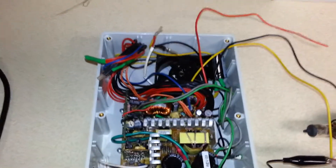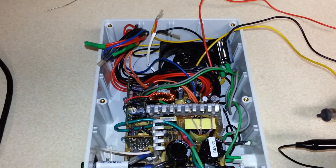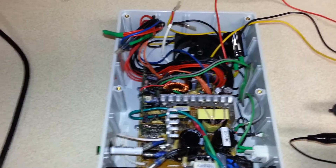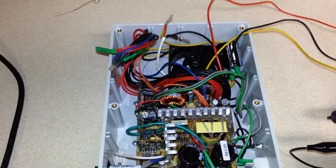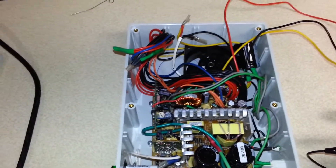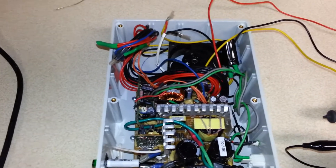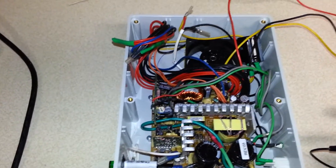That's one of the reasons at our house we've gone to, on all of our critical electronics, a true online UPS system that basically gives us clean power all the time. It doesn't require a switchover when there's a mains failure — there's no switching time because it's already running on battery, it just happens to be charging the battery at the same time. That is not an off-the-grid inverter; all we're trying to do is be efficient while we're on the grid. We have a peak and non-peak rate, so we're charging up during off-peak hours and then using that battery supply at peak rate.